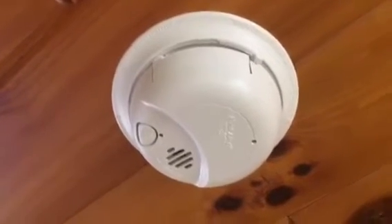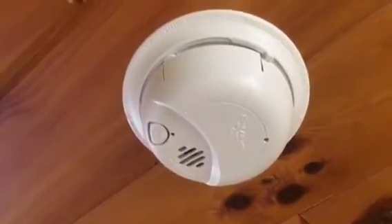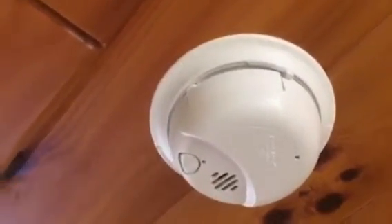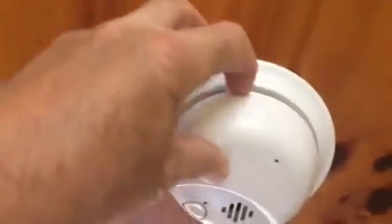In my case, I left for the winter and I would want to remove these batteries so they wouldn't chirp when they got cold and annoy the neighbors all winter. There is a battery access panel on these. All you got to do is push the button in and this flips out. Then your battery pulls down at this end and slides out.